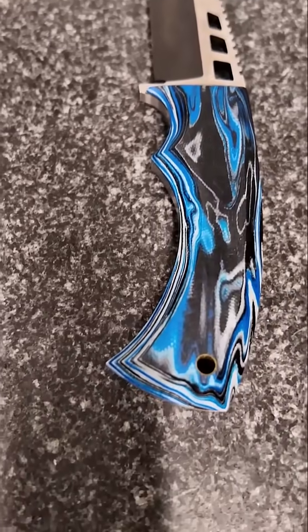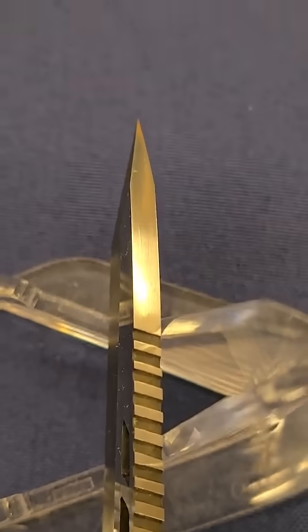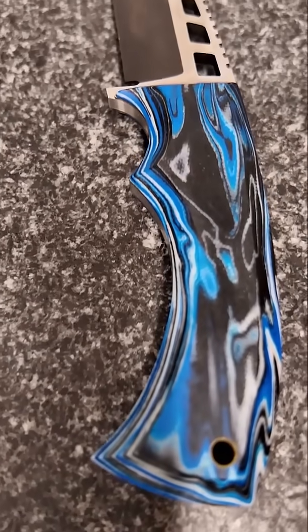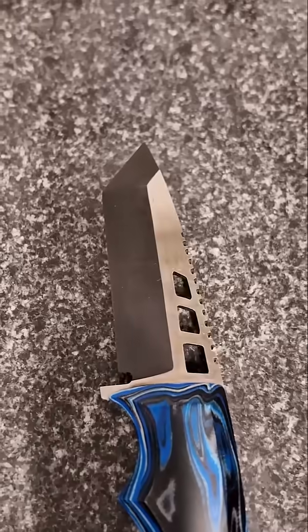What is this, G10 here? That is a G10, sort of a quilted look. File work here for your jimping. Was this bevel done with the router table in the shop? It was done on a router table in a different shop, but that was done with a pattern cutting bearing bit, like a woodworking style bit.